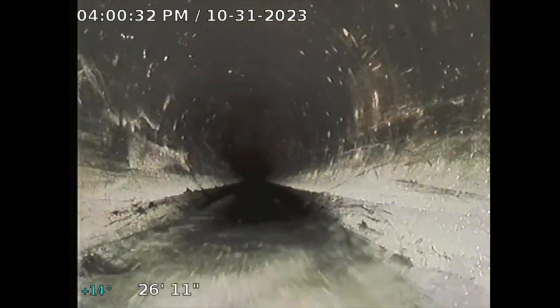Okay, I have the kitchen sink turned on at the rear ADU, and I don't see any water here. So I don't know if that rear sewer line is connected. I traced this whole line, and usually I'll see a gush of water. So I do recommend further review and repair by a licensed plumber. I don't see any water here from the rear unit. I did flush the toilet from the main house, and I saw gushes of water, but there's no water coming out. Here's some water there, but I guess it took forever. That's the water.